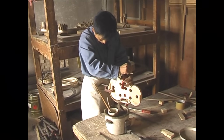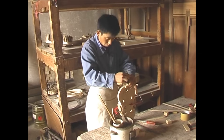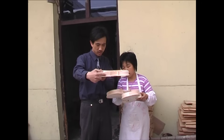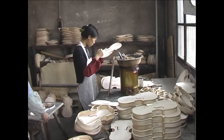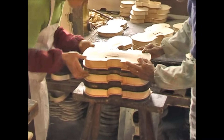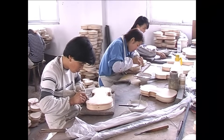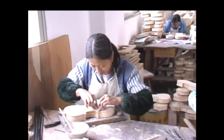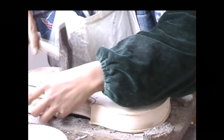The top and bottom blocks are glued in place, then the corners are fitted and the linings complete the rib cage. High grade models are made using an inside mould with the ribs being individually clamped. Inspection takes place at all times. In the body workshop the front of the violin is matched with the back and the rib cage, carefully assembled together, glued and clamped to make the basic body. Every Stentor violin has inlaid purfling — here we can see the purfling channel and how each piece is cut to size with the mitres cut for the corners.